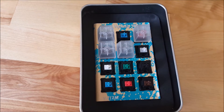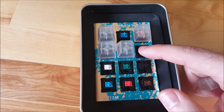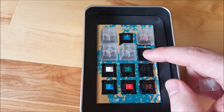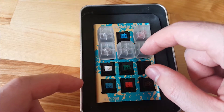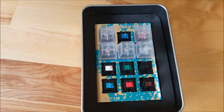Moving on to the next tactile mechanical keyboard switch — we have the Cherry MX Clears. This is a slightly different color; it's more translucent than the white over here, so don't confuse those. With Cherry MX Clear, the actuation force required is 55 centinewtons, so we have 45 and 55. I personally like the Clears quite a bit more than the Browns — they just feel more lively to me.